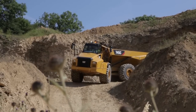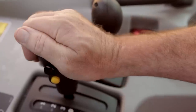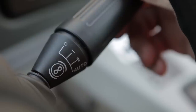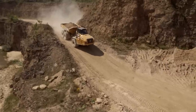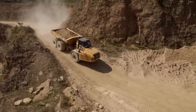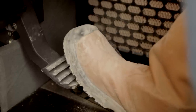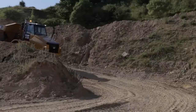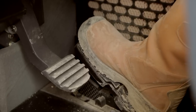If you are not using the auto position, on approaching the descent of a grade, pre-select the appropriate gear and then select the correct stage of retardation using the lever. The gear selected for descending a grade should be the same as the gear used while ascending. Remove your foot from the throttle and cover the brake. The retarder will slow your descent, and when you approach the bottom of the grade, press the throttle to disengage.